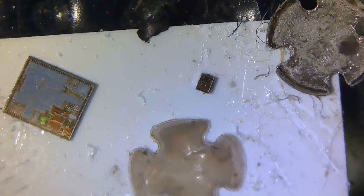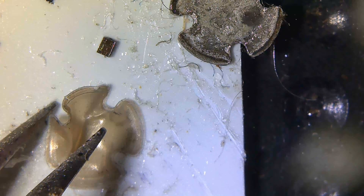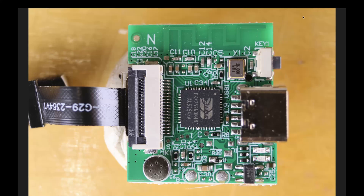Let's take a look at the microphone. There are a couple of pieces here — a metal backing and a very flexible diaphragm. I thought it might be a MEMS device, but it's probably just a little membrane, and there was a voice coil that got dissolved in the acid when I took it apart. That's basically what I extracted from the microphone. Last little bit of interest — let's look at the antenna. One great thing about Wi-Fi at 2.4 GHz is that the antenna can simply be a trace on the circuit board, which obviously helps the whole cost picture. One of the reasons I think Wi-Fi became so successful.